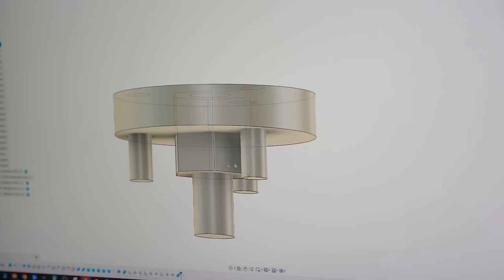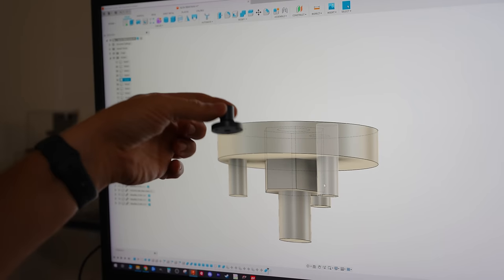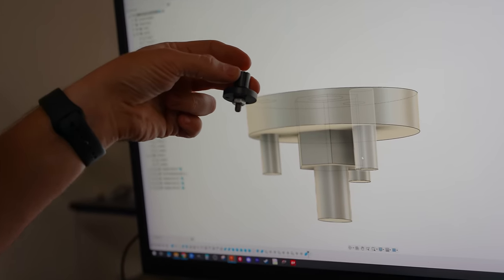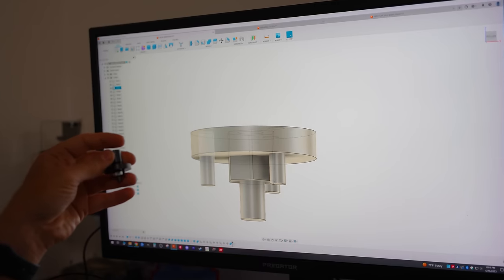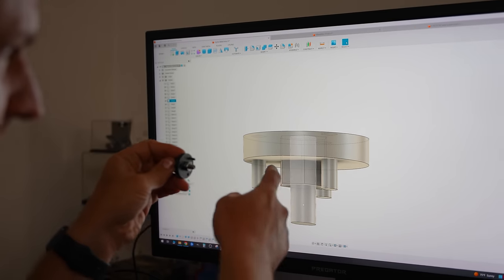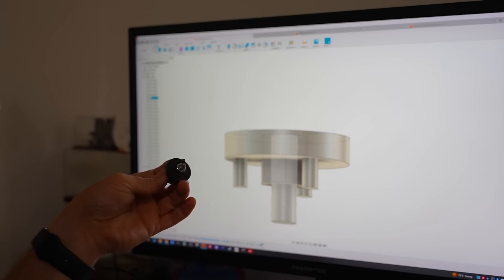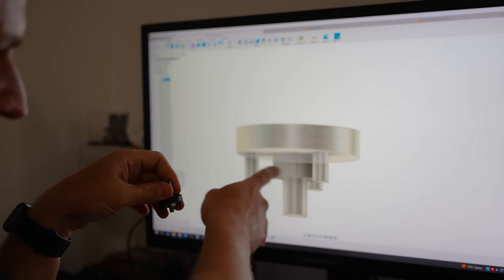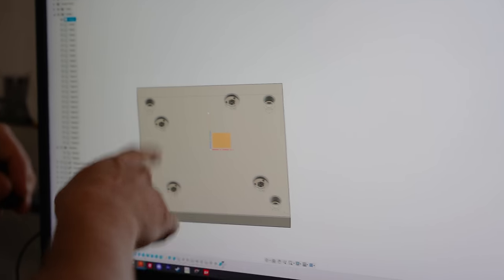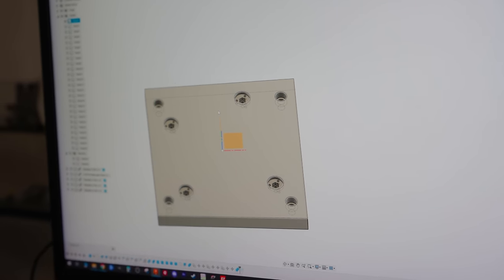Now that I know exactly where those are, I went and created simpler versions of the bodies. And so I made a prong plug of this. That looks like the exact opposite, but it's really not. That's the bottom side of this, and there's three of those there. So that way I know, hey, there's a drill spot here: drill and tap, drill and tap, drill and tap. And then also make room for a nut that's inside there, because you can't tighten this once these are all in there. So I have to mill that out. It's kind of neat because they're in four quarters that should hold the piece as evenly as possible.